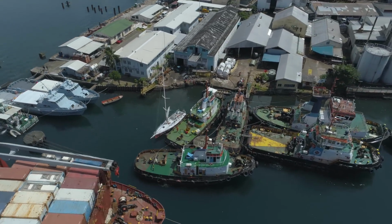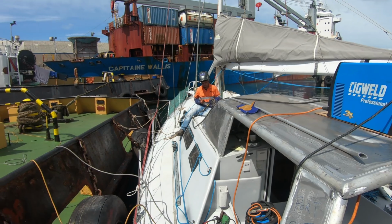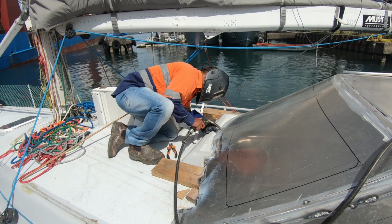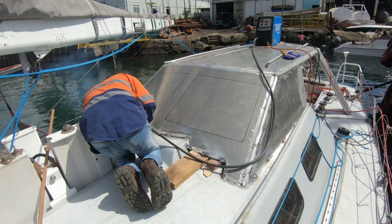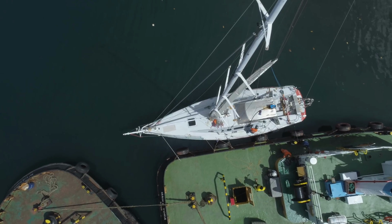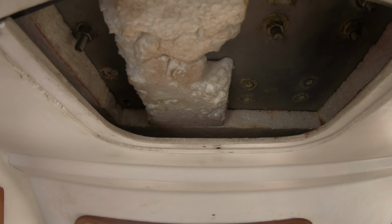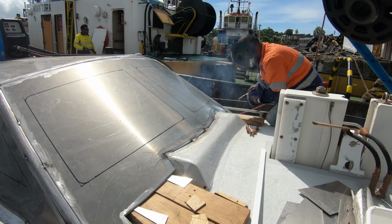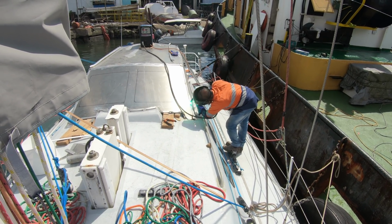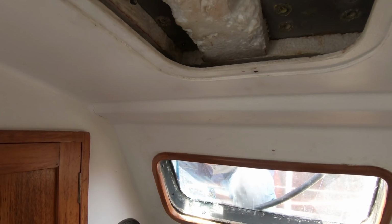Big day was planned, and we took the boat to South Sea Towage Maintenance Base to use their 15 amp power, and Sanjeev completed all the welding. One concern was the headlining inside. I couldn't see a way for it to be removed, and it was about an inch thick of polystyrene insulation. With the heat of the welding, it could melt and start a fire. I talked to a good friend who is a master metal worker and boat builder in Australia, and he said it'd be unlikely to catch fire as there's very little oxygen inside. I did keep an eye out.